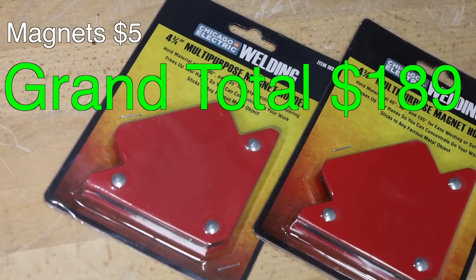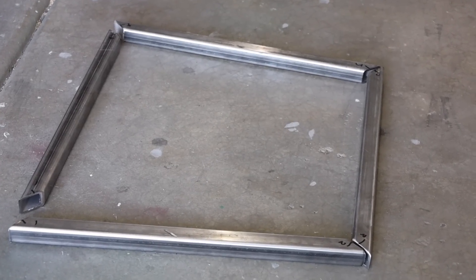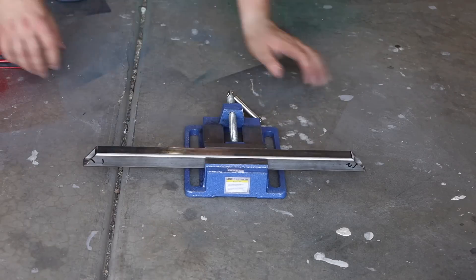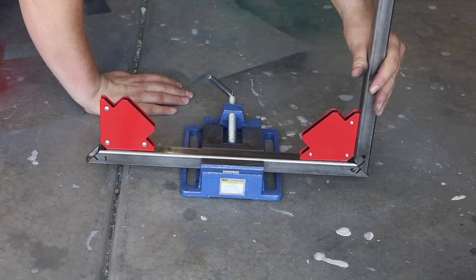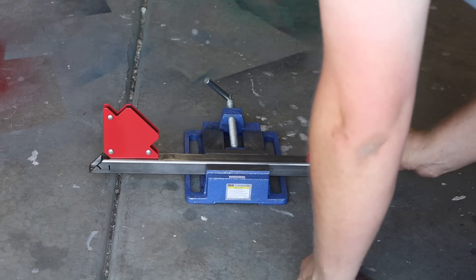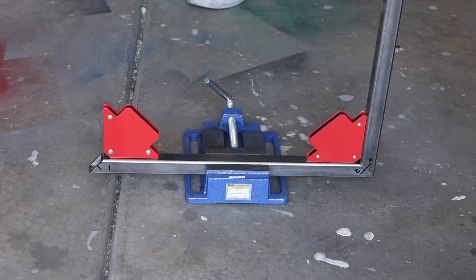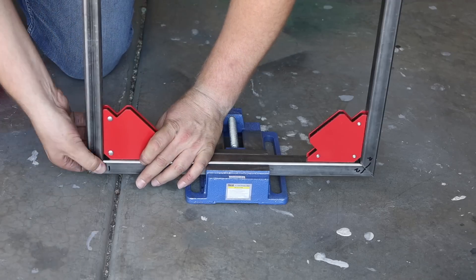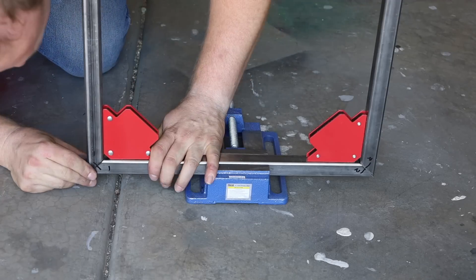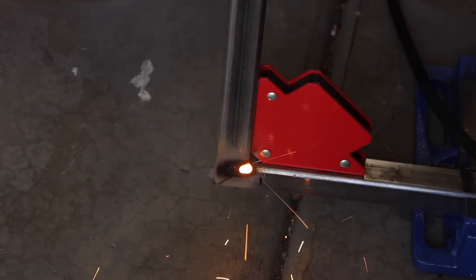Since I can't work on a welding fixture table and the concrete floor isn't flat, my best bet to get things to line up flat is building vertically. I've clamped one piece in the vise, then used the magnetic squares — attaching the next part vertically keeps it from pulling side to side, because the long edge of the square holds it in place. I lined up the notches and tack welded it in place with some 6011.